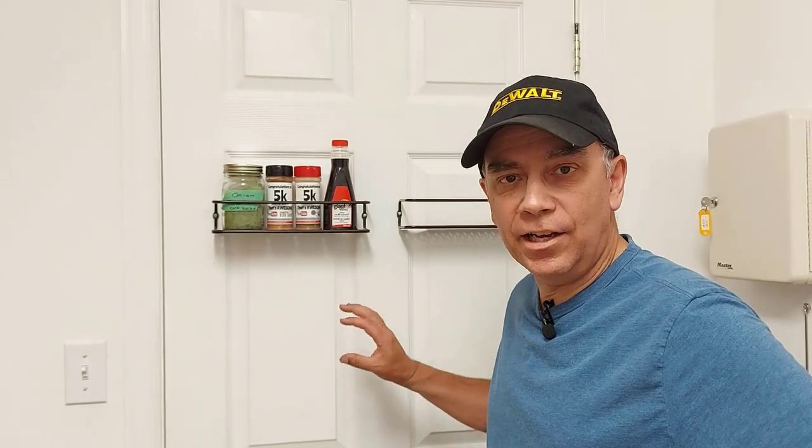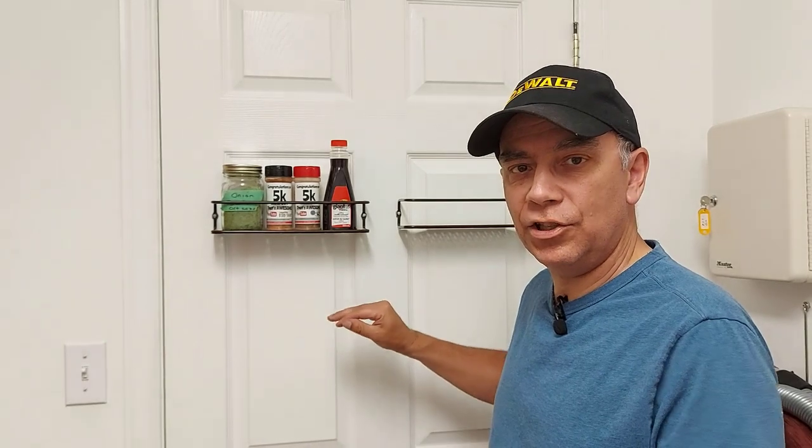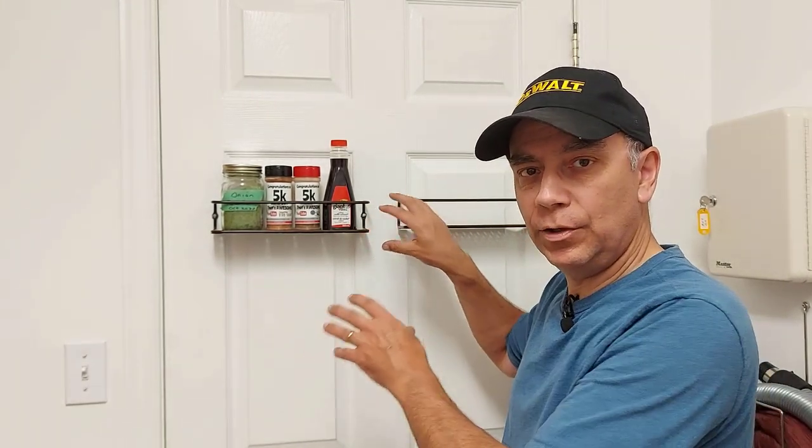When you're hanging objects from a hollow door, you want to use an anchor and something else I'll be showing you in a second. The doors are hollow and the screws will not just hang on to that door. When you drill a hole and fasten any object to a hollow door, over time the weight is going to let go — the screws will come out.